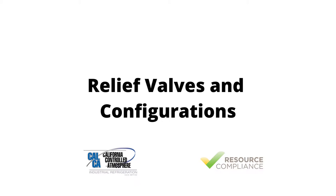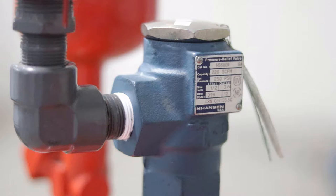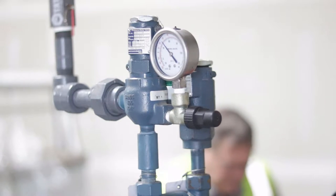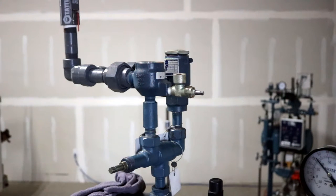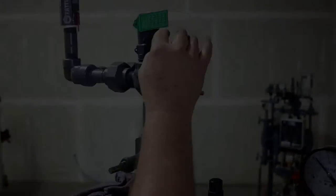First, let's look at various types of relief valves and relief valve configurations. Essentially, all relief valves used in the ammonia refrigeration industry are spring-loaded to pop off at the valve set pressure. In recent years, all major valve manufacturers have begun to manufacture cartridge-style relief valves that render it possible to replace a relief valve without disconnecting the discharge piping. These valves offer substantial savings in labor required to replace a relief valve.